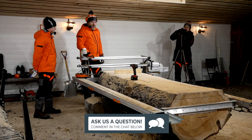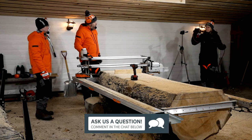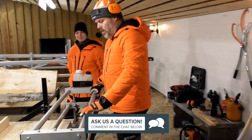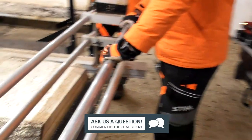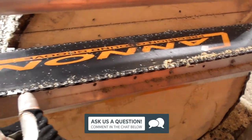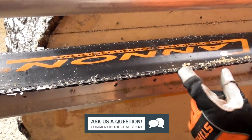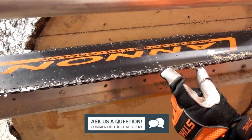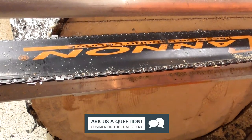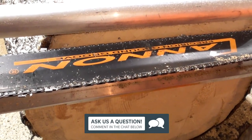So we're actually using the Oregon 27RX. It's a 0.404 chain, 0.404 pitch and 1.6 millimeter gauge. So as you can see here, there is one pair of teeth, and then we have a distance of more than 20 centimeters before we have the next pair of teeth. So it's a really special ripping chain that works very well for these types of applications when you are milling